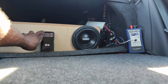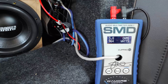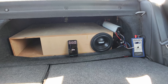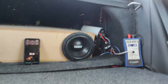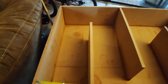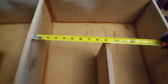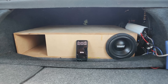Let's press play. That's 964 watts at 3.8 ohms — pulled a 138.4. Let's try that again. Too much power — it bottomed out at 1,300 watts. I've had this subwoofer for a long time and I've never heard it bottom out. That's why I was telling people about these types of enclosures — they'll destroy your subwoofer if you don't know how they work. They don't build up a whole lot of pressure, so you've got to be careful. I'm going to try to burp it at the current level on the bass knob and hopefully it doesn't destroy itself.